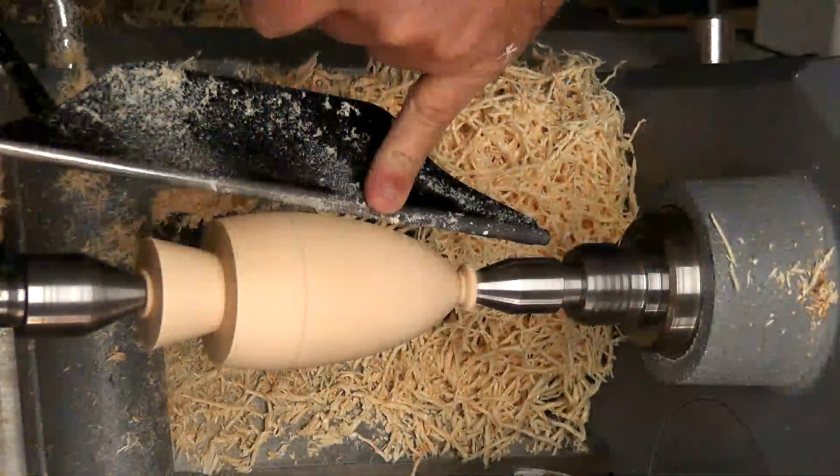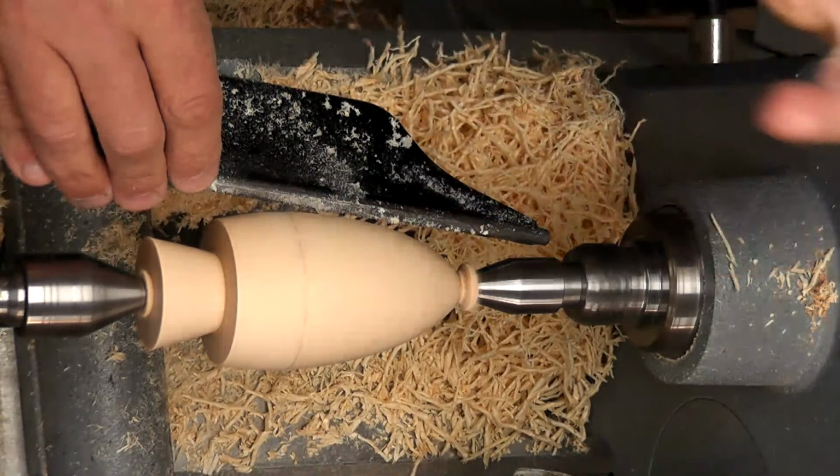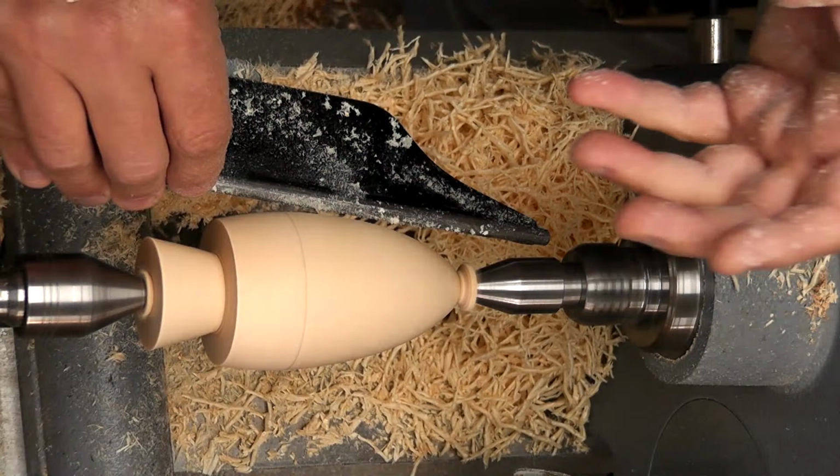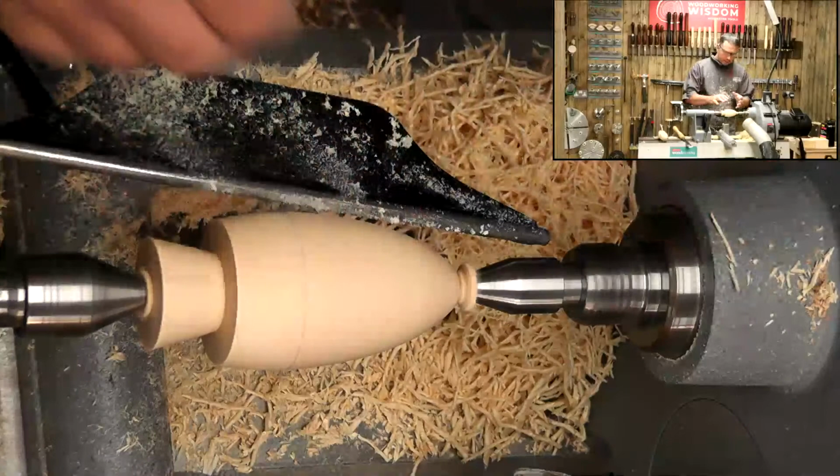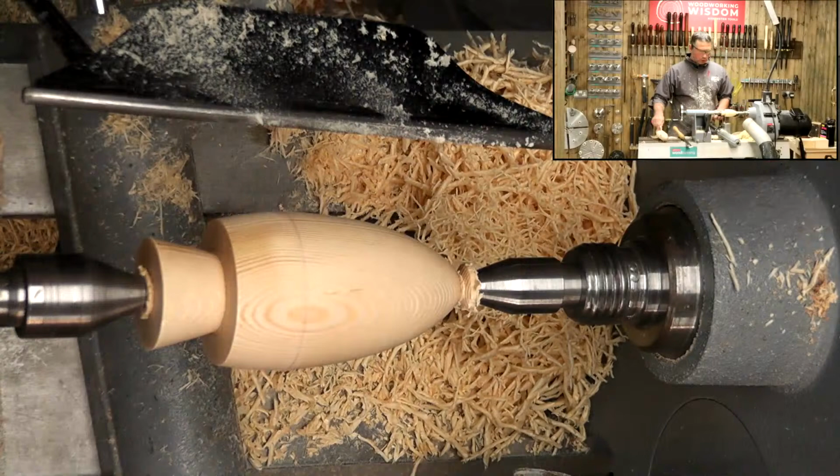So I would probably start here with a 150, go to 240, 320, 400, and then stop there. That should be enough. And a mobile like the one that I've shown you earlier, generally we would paint the figures on that, but of course you wanted to keep it solid timber. You need to make sure that all of your scratches are gone. So there, when you finish sanding, then we can go down and take out those nibs as much as we can and just change the centre.